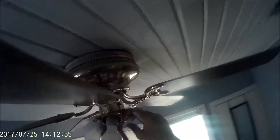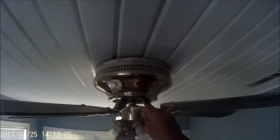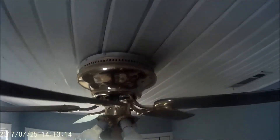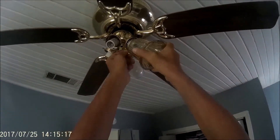Everything's working and I can basically put everything back together. When you put the wire nuts on, make sure they screw on tight so there's no chance of them coming off. I take a piece of black electrician's tape, about two to three inches long, and wrap it around the black wire nut. Because of vibration, the fan does move and over the years it can loosen up the wire nut, potentially causing a short circuit. The electrical tape offers a little extra security and prevents that from happening.